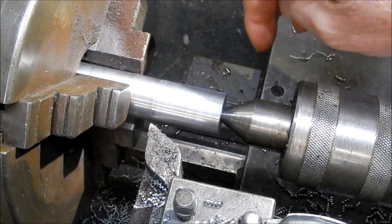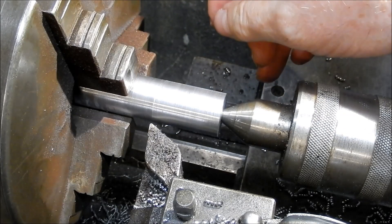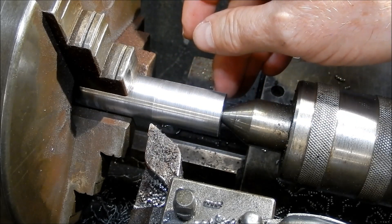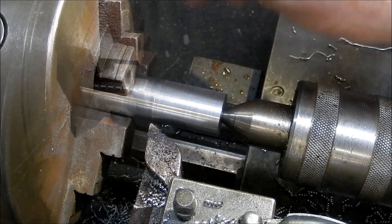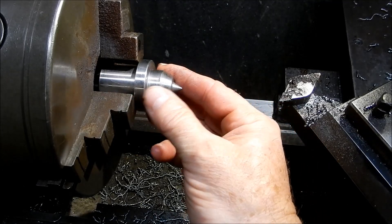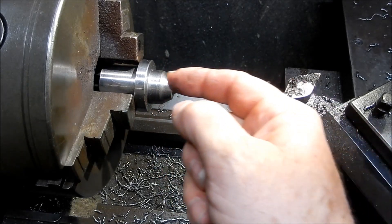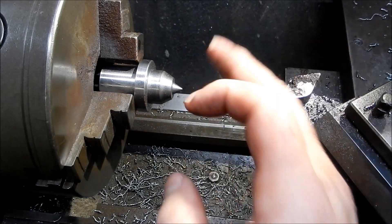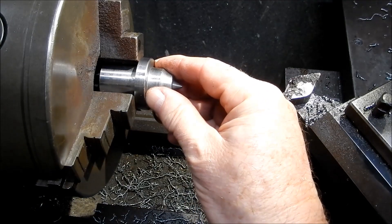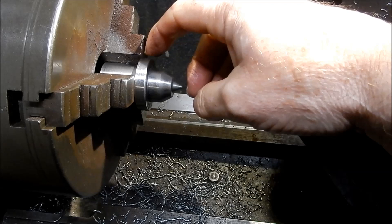Now you can see quite clearly how it's cutting onto the new section of the shaft and missing out on the other side, so they're not concentric — which is what you'd expect. We're going to set up this technique to machine these back to diameter, aiming for 22 millimeters, so I've got about 10 thou — about 0.25mm — left to go, and we're going to do that in one pass. What I have in my tool box is a dead center that I've machined up, and we're going to sit that in the three-jaw chuck and remachine that 60-degree taper which matches our centers. When we remachine it, it will be dead nuts plumb to the centerline of the lathe. It's also important to have a shoulder on it that backs up against the jaws.